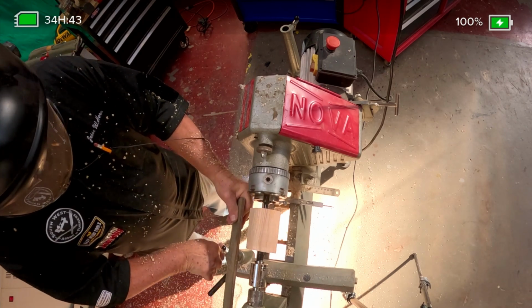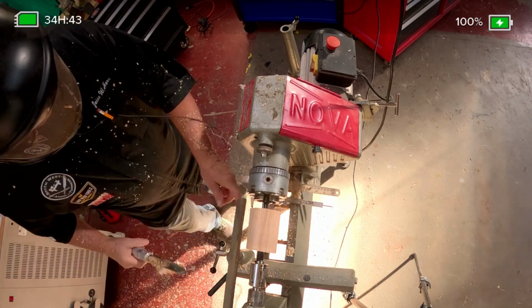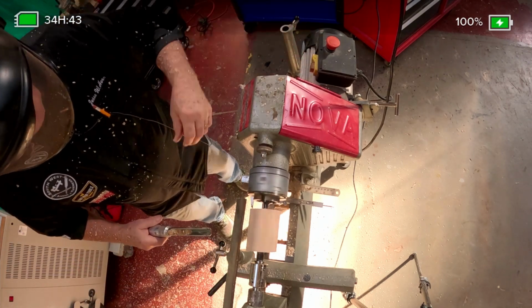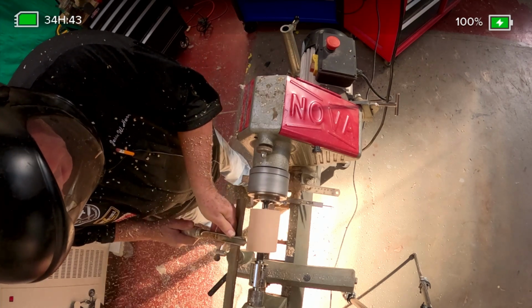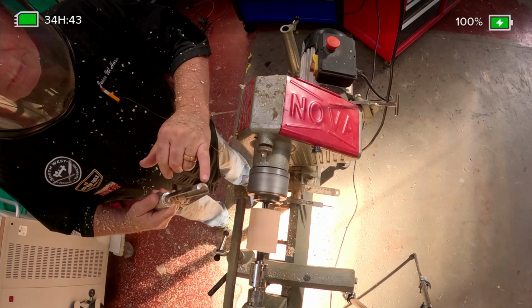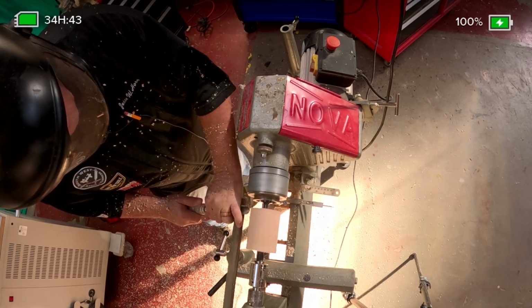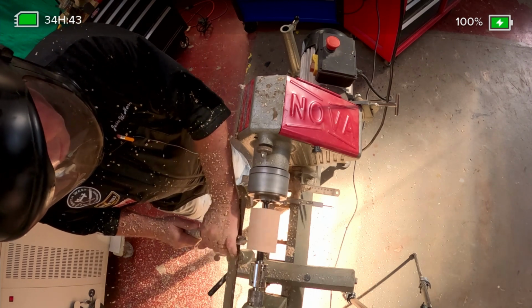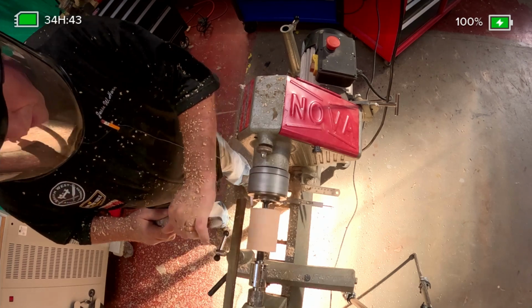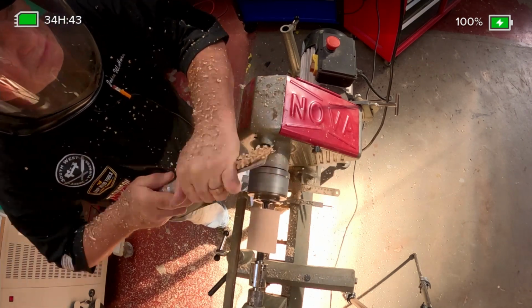And when you're using a roughing gouge, you drop it just a little bit below center. And I'm what I call rubbing the bevel. So I'm riding this bevel. That's how it comes out so smooth. If I were to gouge it in, it would make a big gouge in it, and it would take your tool.